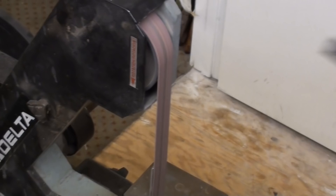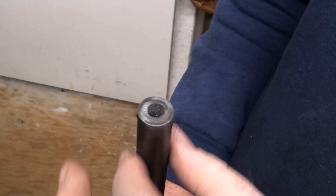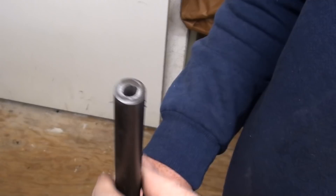Something hard to tell here — this is definitely not finished yet — but if you look as I turn this, the bore is not concentric and centered on the outside of the barrel. It's just the way they do these. They may bore them straight, but sometimes the outsides of the barrels don't get turned on a true center, and you'll find that with a lot of production guns. It may not be pretty, but that's the way it is.